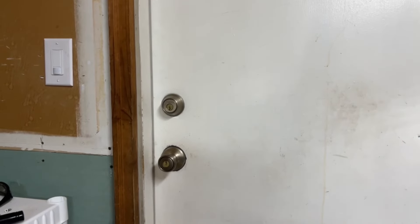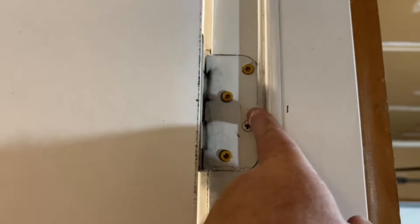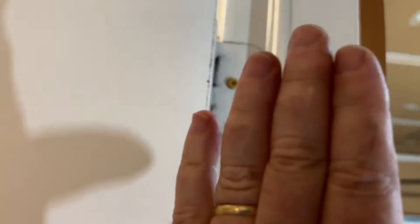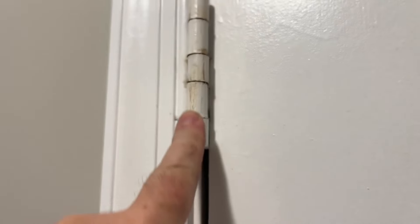It will shut all the way now. That's also with the laundry room door open — when it's closed it creates more resistance and doesn't allow it to shut as easy. To bring the door over, what I did was swap out the screws with longer screws and they pulled it over more. As you can see now at the top, it no longer drags. There we go — I think I'll leave it like that, but if needed we can always add another hinge. That's what it looks like when it's done — not bad for a laundry room garage door. That's all I have for you today, Simple Homeowners. Thank you for watching — appreciate it if you like and subscribe.